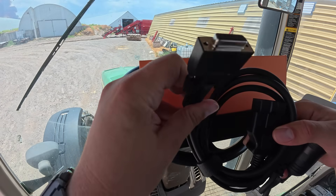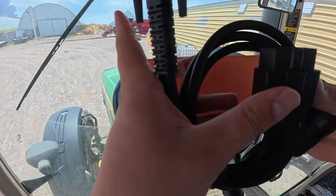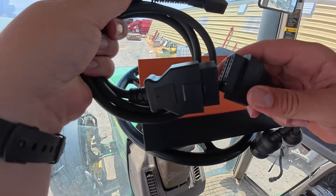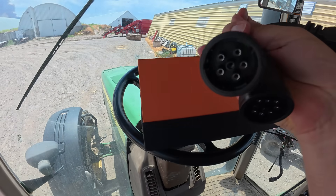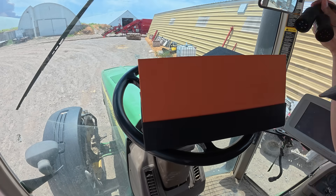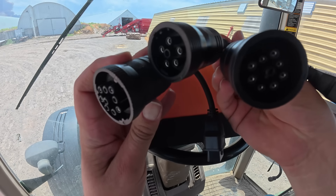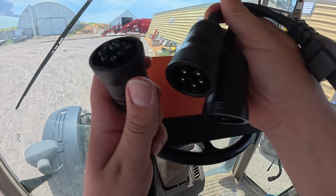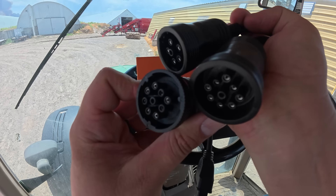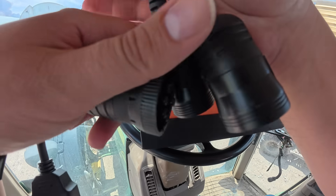This one just plugs into the reader, and then this is your typical OBD-II plug that you could plug right into a pickup — so you can scan codes on your pickup with this too. And then you have these two different plugs. I know one of these is the plug for our tractor. So you've got three different plugs that cover a lot of your heavy equipment — they all use one of these three plugs, which is going to cover the majority of heavy equipment.